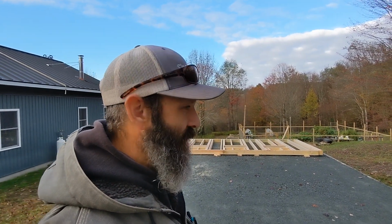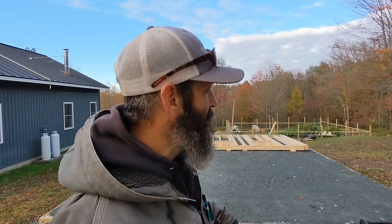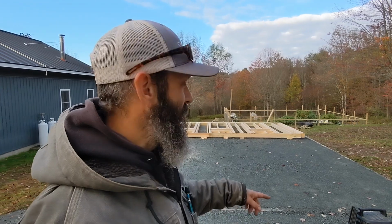But if that wall was up, I could start laying out this wall, get it rocking and rolling, hopefully get that up today too. I don't want to just sit here for the next hour, so I'm basically going to lay out the bottom and top plates this way. I'll just clamp them all together, start marking off this wall. I don't really have much going on.